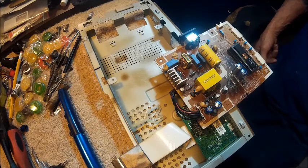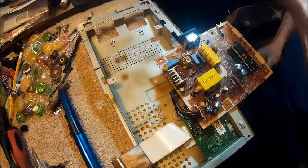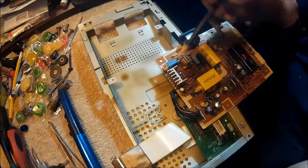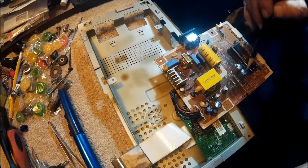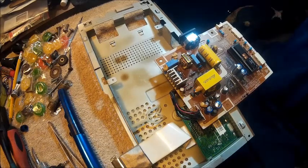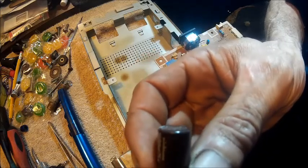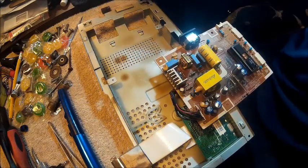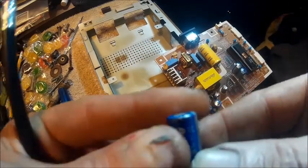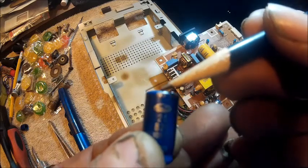The way I fixed my son's monitor was I opened it up and I was looking at the capacitors. You've got one here, one here, one here — just a bunch of them here. The way you can tell if they're bad: I'll show you a good one. This one here is a good one — see the top of that, how flat it is? That's a good capacitor. See how bulged the old one is? Right here on top of that you've got a bulge. Well, that's a bad one.